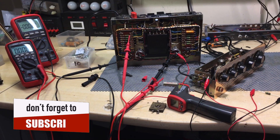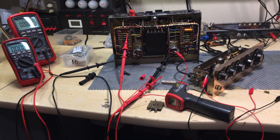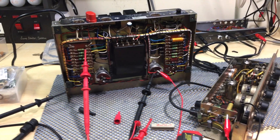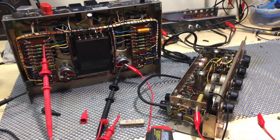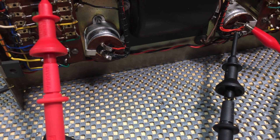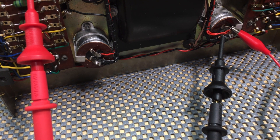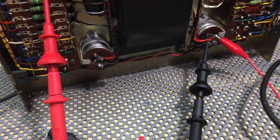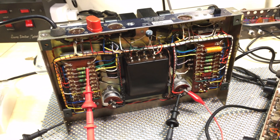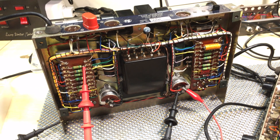Don't panic — I've already panicked, so one of us is enough. What you see here is my messing around trying to get the voltages right. I powered this up and noticed that the front panel was getting very, very hot. The only thing connected to it is the main selenium rectifier, so I figured it was dropping too much voltage and I wasn't getting my 265 volts. So I decided to reform and rebuild that rectifier.